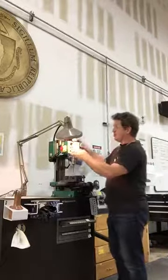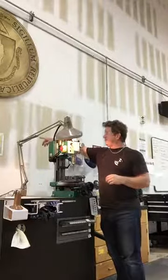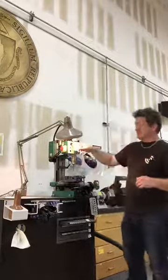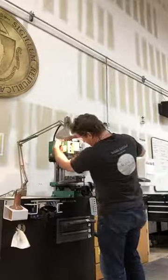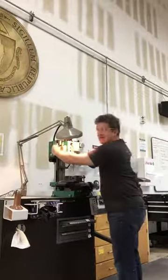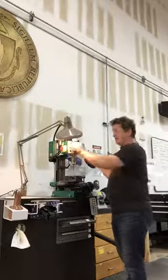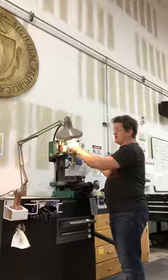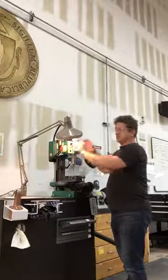When you're ready to drill, make sure that you are set to an appropriate range for the tool. The tool diameter is being given back here along with the RPM values. There is a high and a low to this tool — on the back side behind the gear there is a range switch to put you into high gear or low gear depending on where you need to go. After you've got that set in the correct gear, you can turn it on here with the on switch and bring it up to speed with the RPM values to match what you're drilling.